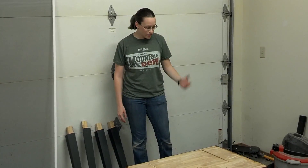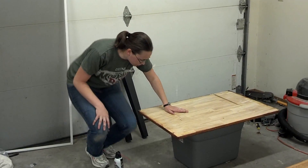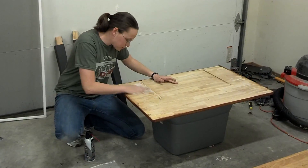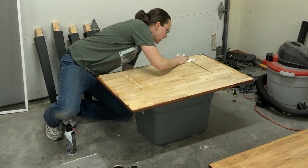Hi, I'm Kelly and for the last two weeks I've been redoing my dining room table and I'm ready for stain. But before you actually do stain, you want to make sure after you've sanded or stripped and sanded that you go through and you clean the entire surface.